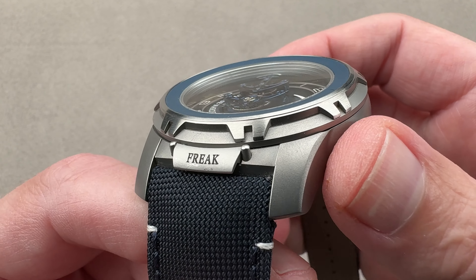You can see the mainspring with seven days of power reserve. As it becomes more coiled around its center and the coils move from the outside to the inside, it is moving towards fully wound — when those coils reach the center, it is fully wound, allowing you to visually estimate the power reserve. The caseback also features a lovely wave motif, a sunburst over the bearing center with blued screws, and a sunburst over the barrel cover below the sapphire viewport. Beat rate is four hertz — eight beats per second.